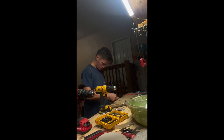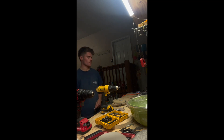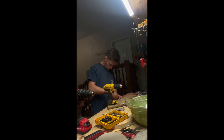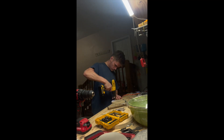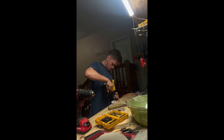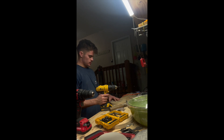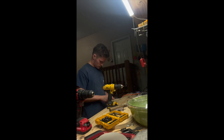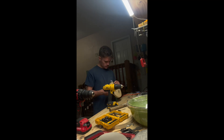Alright, here's the same day but a different angle. Right here you can actually see I'm putting on the push plates onto the 8-inch diameter — this is the piece that gets pushed by the bolts so we can adjust the angle. I also want to clarify the kind of plywood I was using: maple sanded plywood from Lowe's. It didn't cost me too much — I believe it was around $32. Do make sure if you're following along to put the push plates in the right spot, as this can become a problem later on. It really helps if you're double-checking.